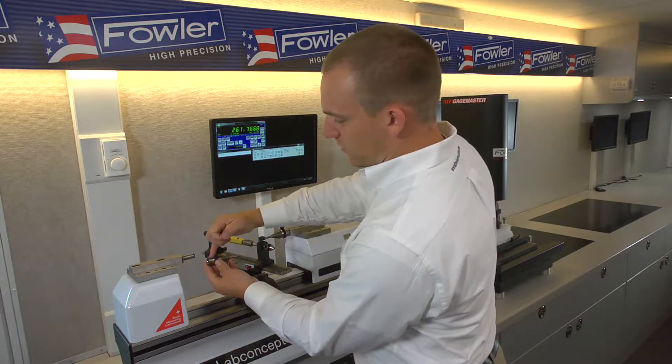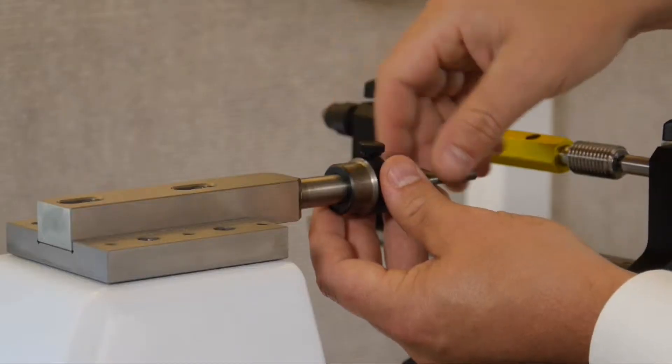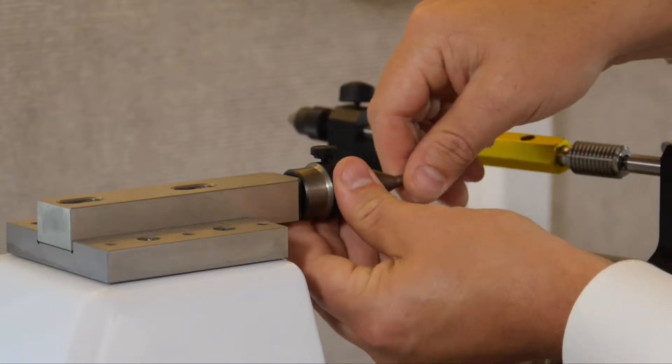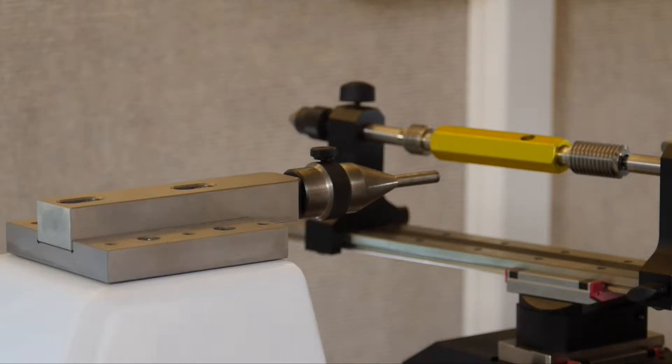On the left side there's a single hatch mark which matches the marking on the anvil mount. This slides right over the top until the bottom's out, and then lock it in place with the set screw on top.